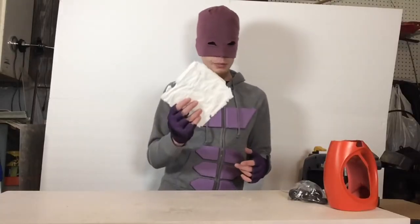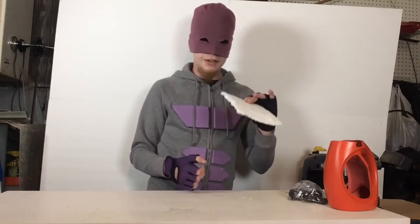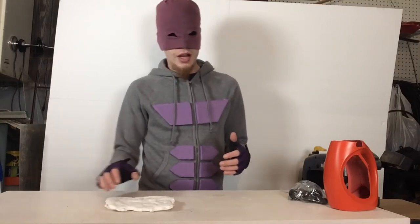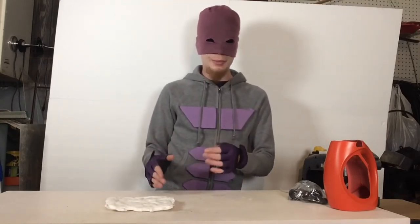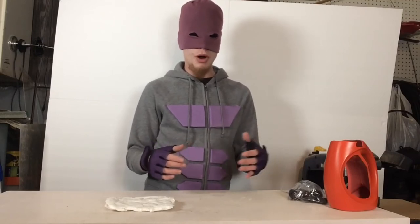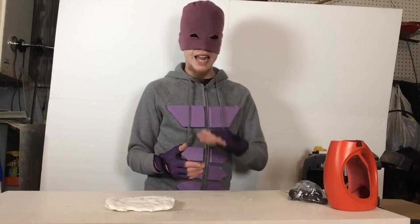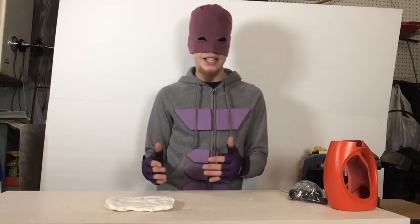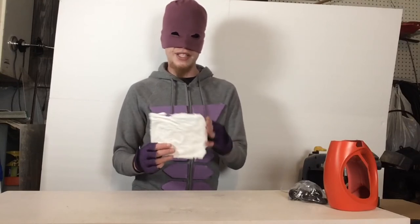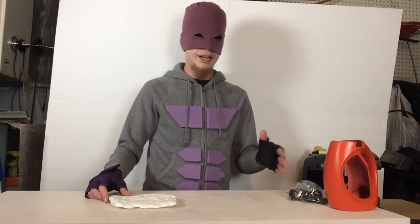At this point you're pretty much finished your HDPE armor plate — a resilient piece of plating you can use for different projects and armors. You could trim it down, add more pieces in the toaster oven or panini press for a smoother surface. You can sand it, paint it, or spray paint it for many different projects. All the trimmings that come off can be recycled as long as they don't have any paint or contaminants on them.